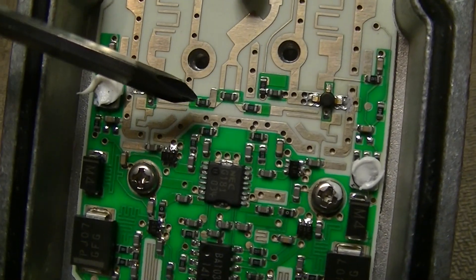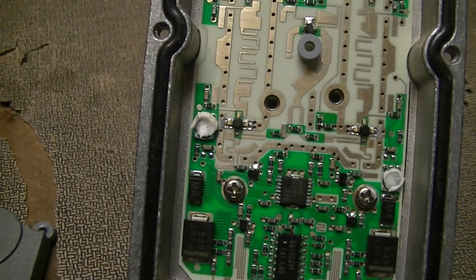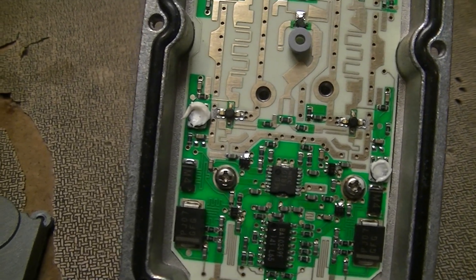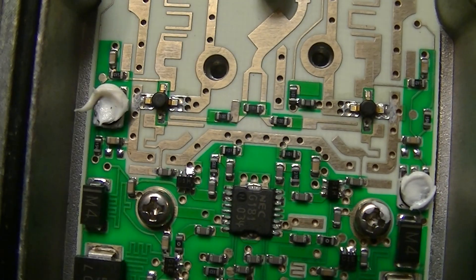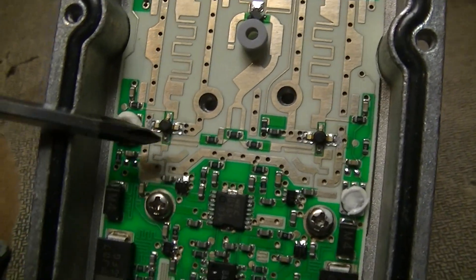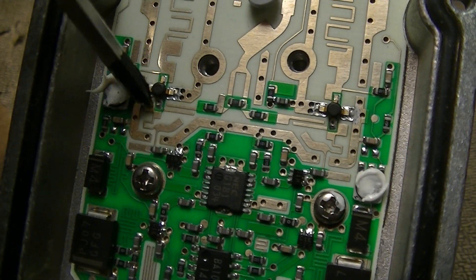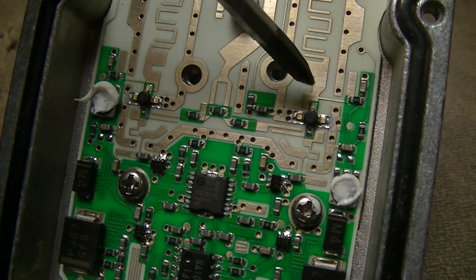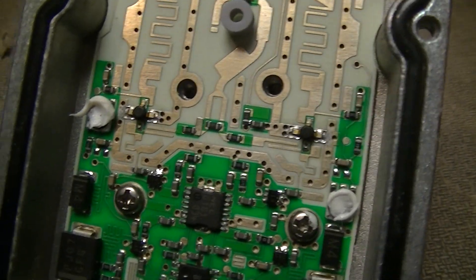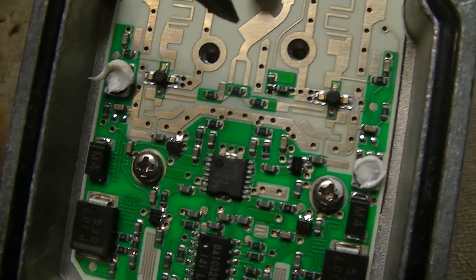So this is an oscillator, I'm guessing. Then down here is the mixer for the intermediate frequency stage. When combining two different frequency signals, what are known as beat frequencies appear at the sum and the difference of those two. The lower of those beat frequencies is going to be the RF signal sent out to the cable box. These traces and fairly thin ones are just filters to cancel out — or filter out — the satellite signal, the oscillator signal, and the upper beat frequency.